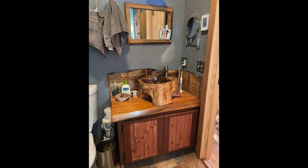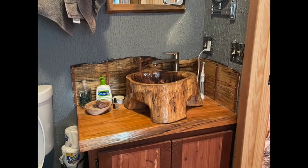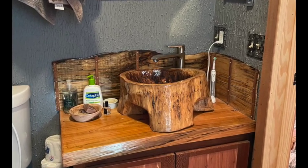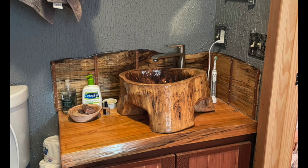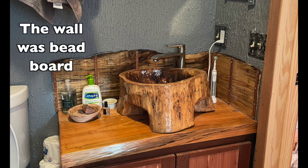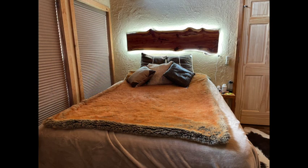This is the final shot of the bathroom vanity with the faucet installed and a mirror that is also a live edge cypress mirror. I used a set of antlers to hang my towels and a backsplash of very thinly sliced spalted maple, which I sealed. Since the original beadboard was terrible, I covered the walls with a roller technique called 'tree' that looks like tree bark — rolled joint compound and then painted a medium gray.